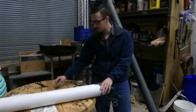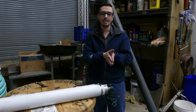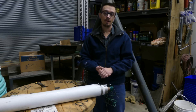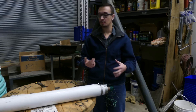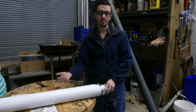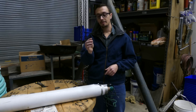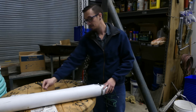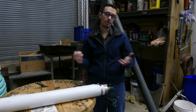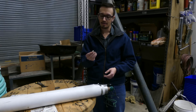The next thing we have to do is put some set screws in the PVC to make sure that the motor doesn't lean against any particular side of the flow sleeve, because then you can get hot spots and you're actually doing the opposite of cooling — you're insulating that section of the motor. So the idea is to drill three equally spaced holes and put some set screws in. I'm going to use Allen head screws. I'll probably have to trim these bolts down a little so they don't stick out too far and get hung up, but I like them because they have a small head.